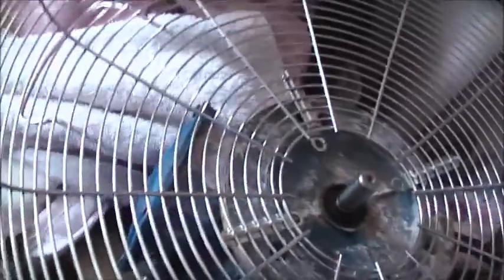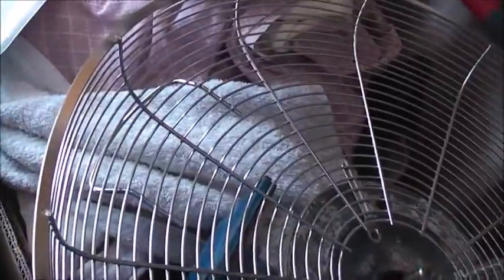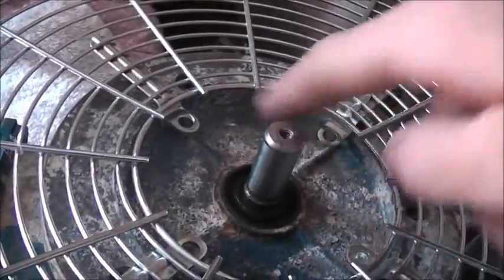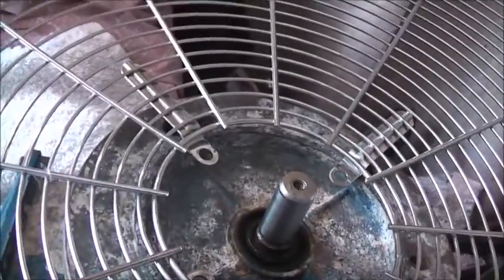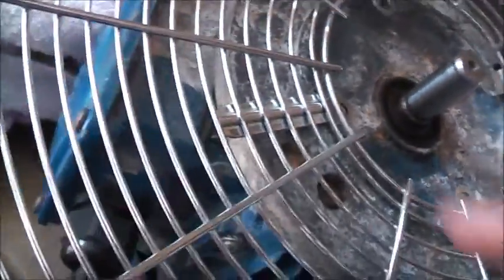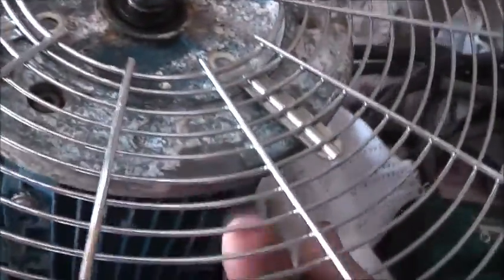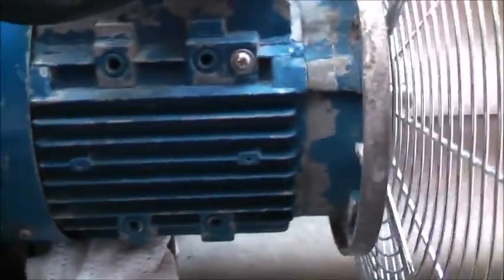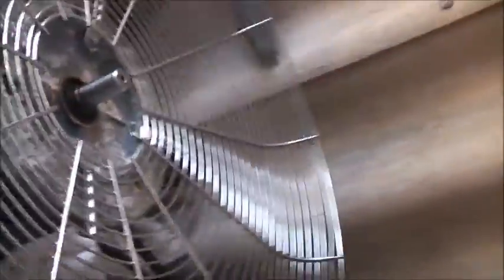It would be a challenge to try and get that blade to adapt to the shaft of that motor. I'm going to make some sort of adapter plate to go in here, from here to these outer bolts. That's the main challenging part. It kind of sits straight though. The way these things are bent, it sits almost perfectly inside the front flange. I could put something in there — put some washers in between there and just bolt it up. Equal amounts of washers between this fan and this face plate here, and bolt it down square. That might also work. It might look very good, though it might squash to the shape.